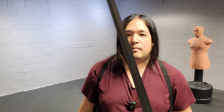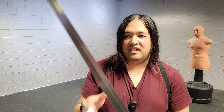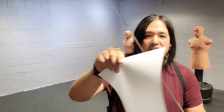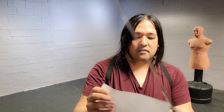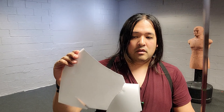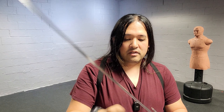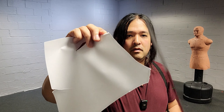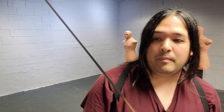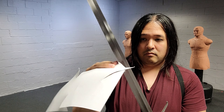Let's talk about sharpness. This sword came remarkably sharp for one I thought would probably come somewhat dull. I've read in the past that Cult of Athena has a subpar sharpening service, but I think these swords actually come sharpened from LK Chen, because I do not see a secondary bevel on this sword at all. Even my Dark Sword Armory swords came with a slight secondary bevel. This looks like a single geometry bevel going down to the edge, which is super impressive for the price. Sub-$400 and you have good edge geometry — that's pretty awesome. It is sharp evenly all the way from the tip down to the ricasso.